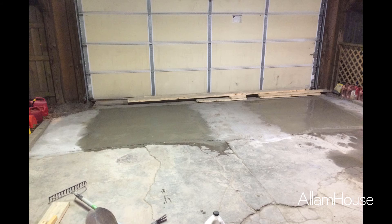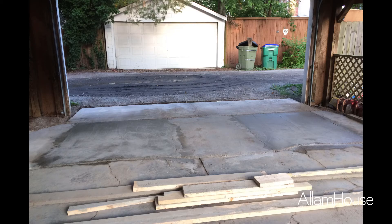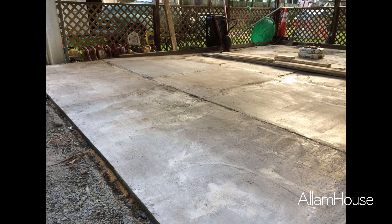Moving on to section three — I filled everything in, got it all leveled out and pulled nice and even. There was still a gap of about an inch where the new concrete ended and the existing concrete continued, so I came back and put in some self-leveling concrete to skim it out and even it up. The next morning it had dried and I was pretty happy with it — time to get back to work to fill in all the little divots and cracks.